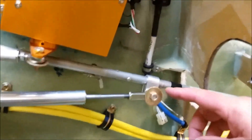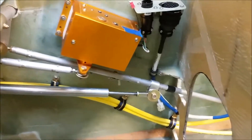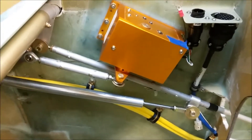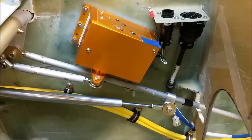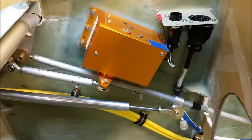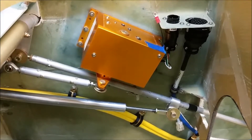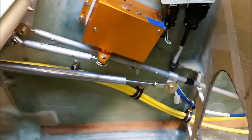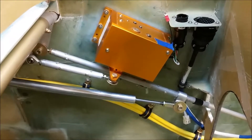This little bracket right here — Marco made that, and I think it would work great if this actuator system right here wasn't a hair off the center line. But with it being off center line a little bit, when it moves, I can see when it pushes — when I hit the trim button up and back — I can see when this tries to push and it shifts like that, there could be a loss of motion there.